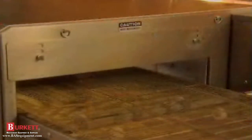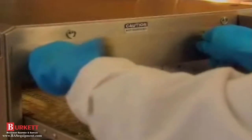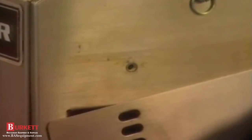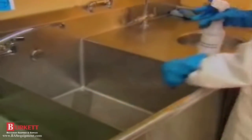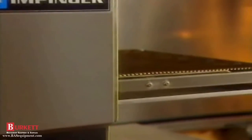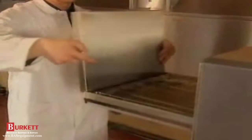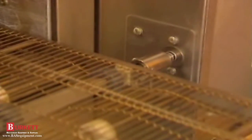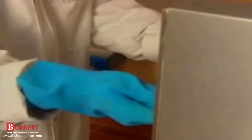With your goggles and gloves on, you can start your weekly cleaning. The first weekly cleaning task is removing and cleaning the conveyor and end baffles. Remove the end baffles by turning the thumb screws counter-clockwise. Spray them with the non-caustic degreaser and allow them to sit while cleaning the conveyor. To remove the conveyor on an Impinger 1300 series countertop oven, remove the external crumb trays, extended conveyor only, and take-off shelves if applicable. Hold the spring-loaded coupling and pull it away from the conveyor. Then lift the conveyor so the locking bar is clear. If the conveyor won't release easily, lift the opposite end and push.